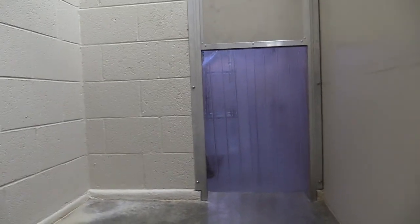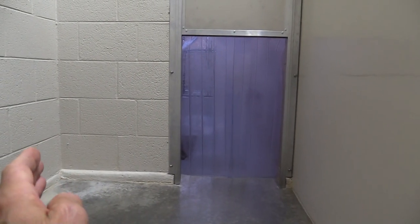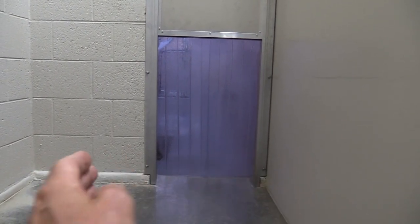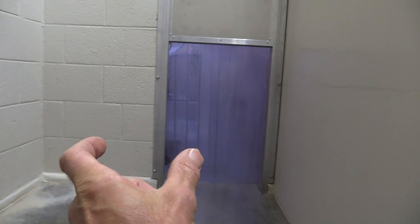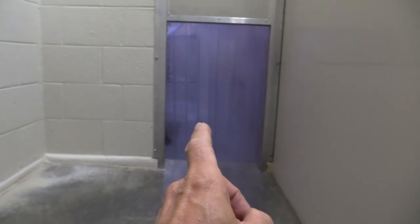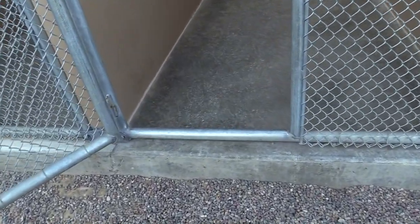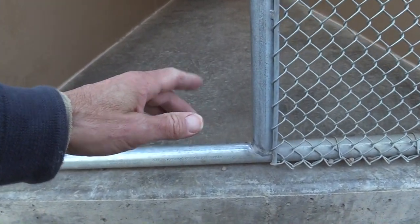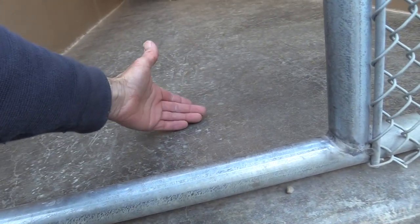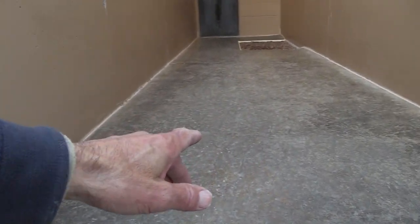The dog door offset to one side. Conventionally kennel doors are in the middle. I've been in kennels where you're hosing out debris from one corner and it goes to the next corner, and you're bouncing debris back and forth trying to get it out the door. Offset the dog door to one side and you've got one corner — easy to hose straight out the door. You'll save a lot of water and time just by offsetting the door to one side. Also, for male dogs that pee on the exterior gate pipe, consider sloping it from about a foot back slightly to the outside so it drains outside rather than back inside where they'll track it everywhere.